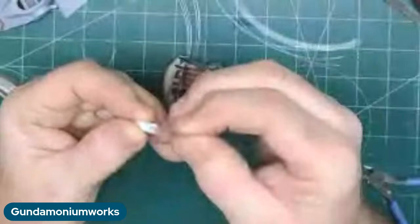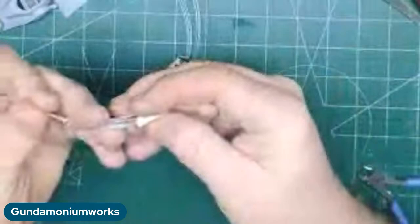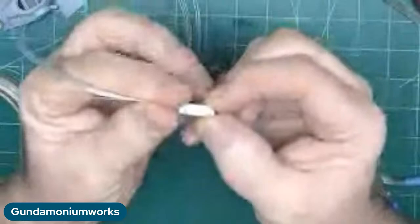And then I can wire the back of the LED. What I do by using this piece of plastic tube is, because the LED is inside, when you put all these fibers in, let's see if I can get them all to bunch together for a second. So, install all these fibers in the tube. Okay, now you've got your LED on this side and all of your fibers on the other side. And that way, the light focus will be right on those ends of the fiber and give you a good source.